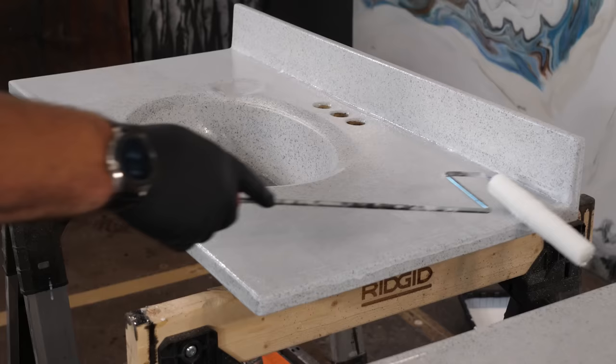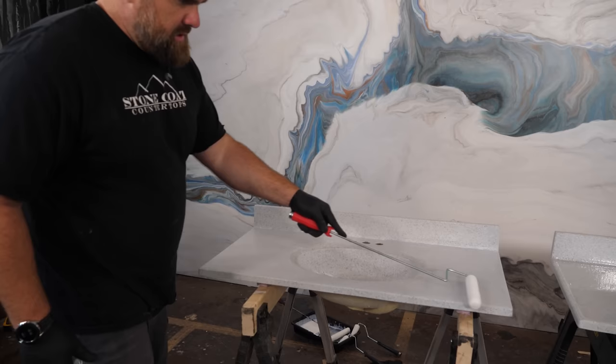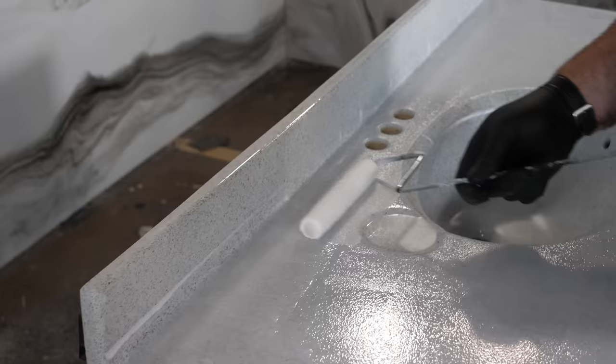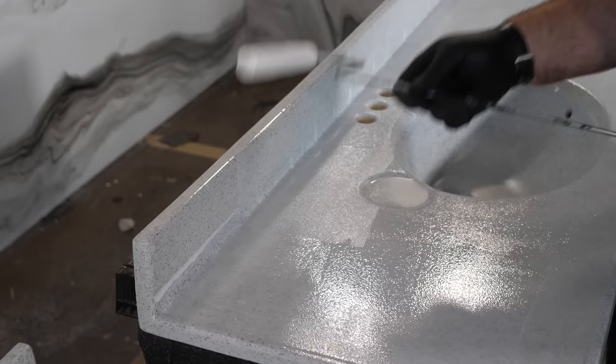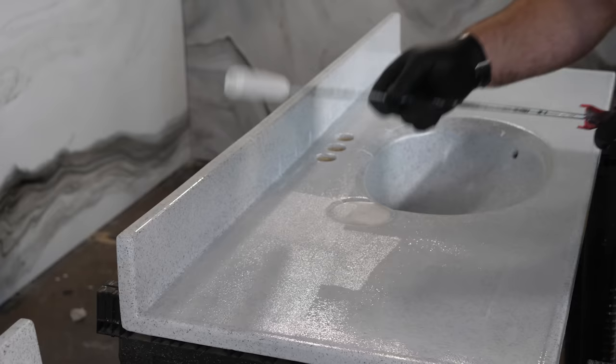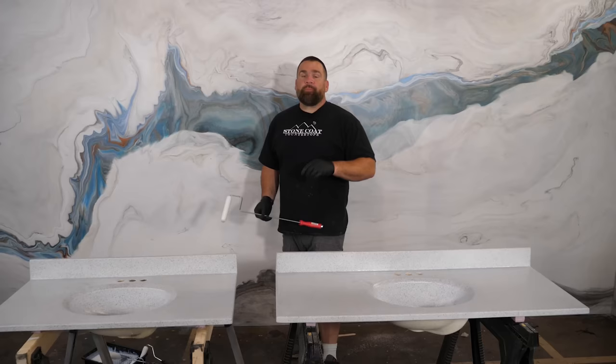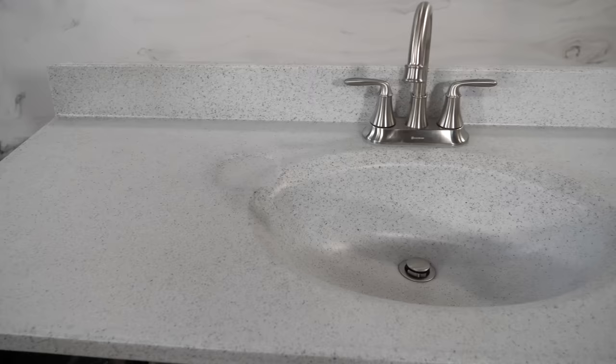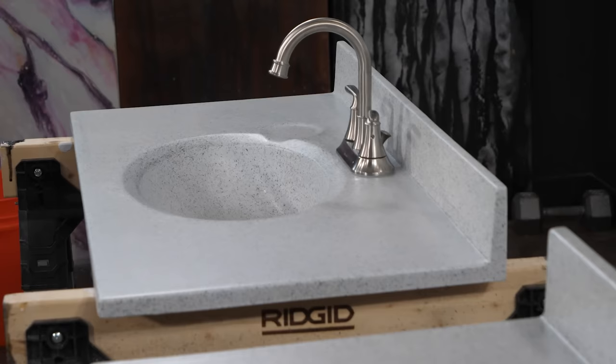You have a little less working time with the top coat than you do with the epoxy. Just lightly roll the whole surface. The top coat goes on milky but will dry 100% crystal clear. The trickiest part is the backsplash, but it's not really hard at all. The Ultimate Top Coat will be dry to the touch in 8 to 10 hours and ready for install. The next day I'll be back to install the faucet and tail pieces. These are what you call a flop-and-drop install — apply some glue, set it right back on. Just hook up your water supply and tail piece. This project's done.